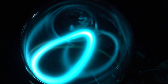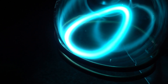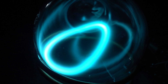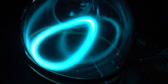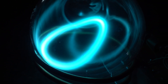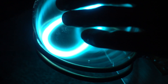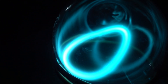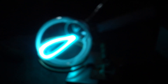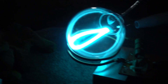Wayne, is this the first time you've done mercury-xenon? Yes. Wow, that is gorgeous. It's filamentary like the xenon, but it's blue like the mercury. And it beads capacitively — I did not predict this happening. It's a very conductive gas mixture, fairly high pressure relatively speaking. Mercury, which is very easy to light, produces a lot of light output. If we had a phosphor in there, it would be brilliantly bright.